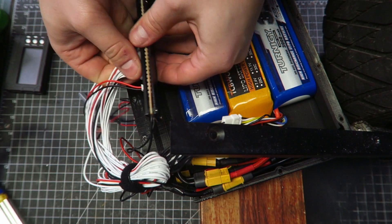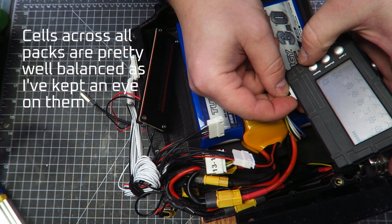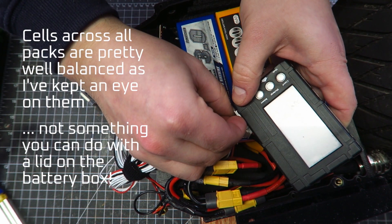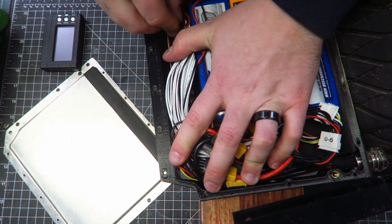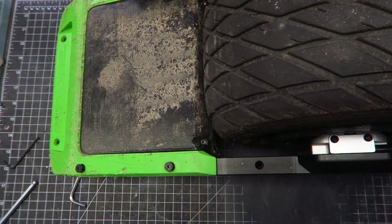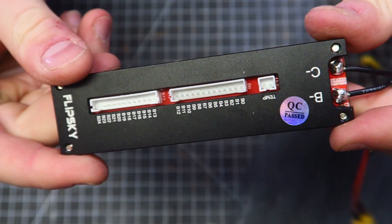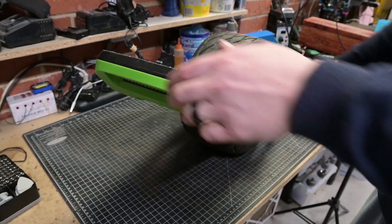This is because the charger is still supplying a minute amount of current, and herein lies the problem with this BMS. If you disconnect your charger from your battery too quickly after completing a charge, you don't give this device an opportunity to balance your cells, so you may still end up with a battery that has cell voltage drift over a period of time. And if you leave the charger connected too long, you're generating excess heat in your battery compartment through the BMS bleeding off that extra energy. Not having any functionality to actively balance your battery as you ride, nor having any functionality to remotely view cell voltages makes this product hard to recommend. But if you understand how to use it, it's perfect at what it does. Anyway, let's get to riding!